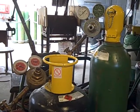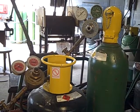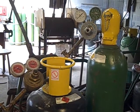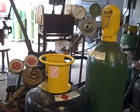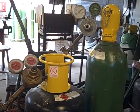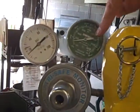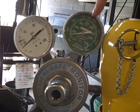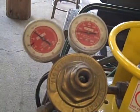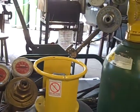This is how we bleed the oxyacetylene tanks in welding and jewelry. The first thing you're going to notice coming out into the welding studio is that there is pressure on these lines. Pressure is indicated by this needle being above zero on the oxygen regulator and here on the acetylene regulator. So we need to get that gas out of those lines.